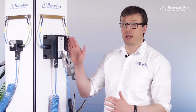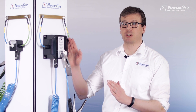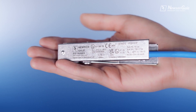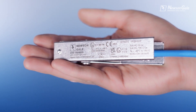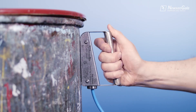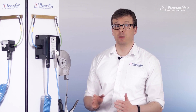For visual indication on a wall-mounted unit, the BondRite 2 Remote provides the same intrinsically safe IA monitoring circuit as the BondRite 2 Clamp and BondRite 2 EZ. However, the high-intensity green flashing LED circuit and battery are mounted to a wall-mounted enclosure to provide indication away from the clamp, making it visible to a wider area in varying applications. The BondRite 2 Remote allows for the use of any of our two-pole clamp range depending on the process requirements — for example, a clamp designed for open vessels or a magnetic clamp for ferrous metal drums. The BondRite 2 Remote is available in a GRP or stainless steel enclosure.